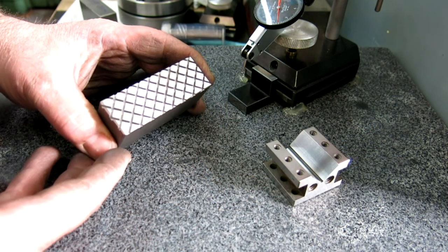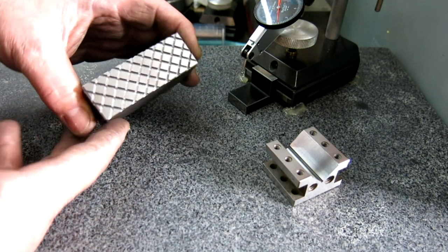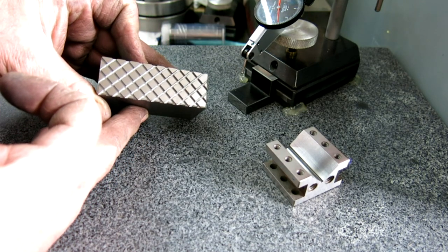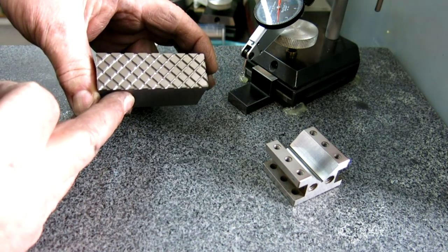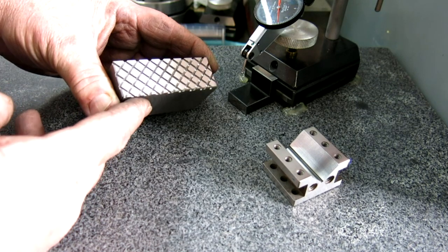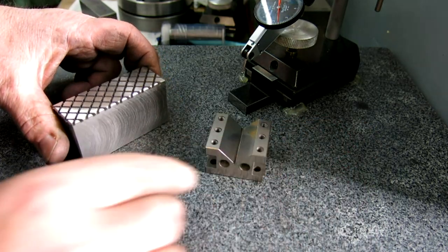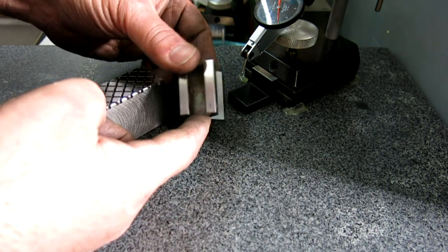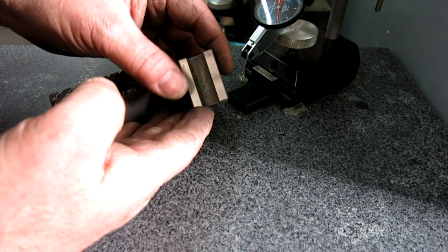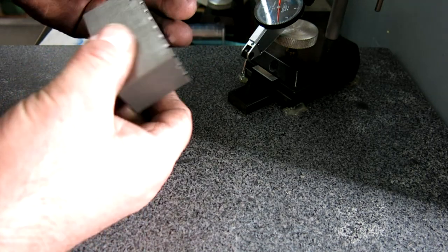There's the finished lap — I cut it at 90 degrees the other way. You can see it's pretty good; I got one that's kind of off a little bit but it's still going to be fine for the lap. Then I surface-ground the top of it — it's a small enough piece that it's going to be flat enough. What I'm doing here is I reground this cute little Anton V-block — I reground the outside of it and the V.